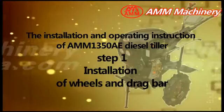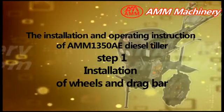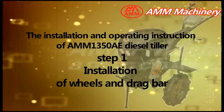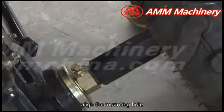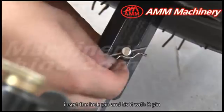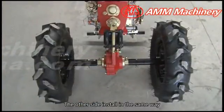The installation and operating instruction of AMM1350AE diesel tiller. Step 1. Installation of wheels and drag bar. Install the wheel on the output shaft. Align the mounting hole. Insert the lock pin and fix it with R pin. The other side install in the same way.